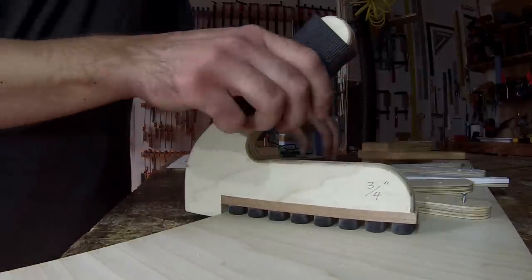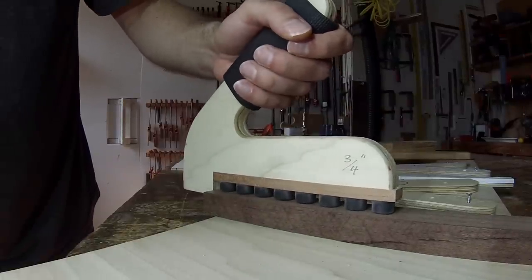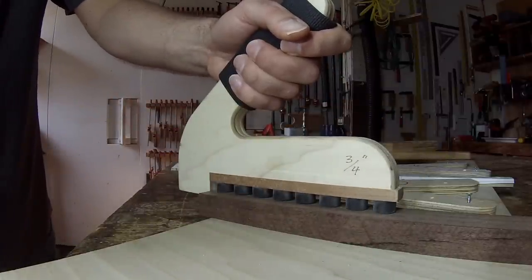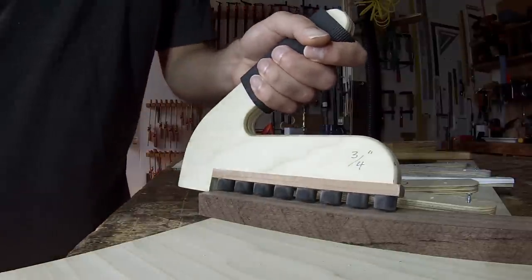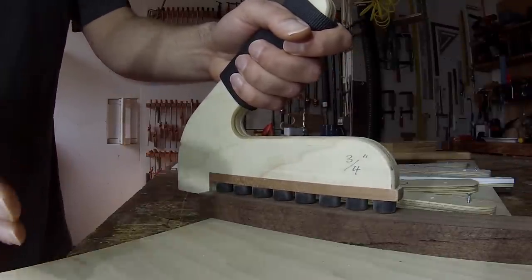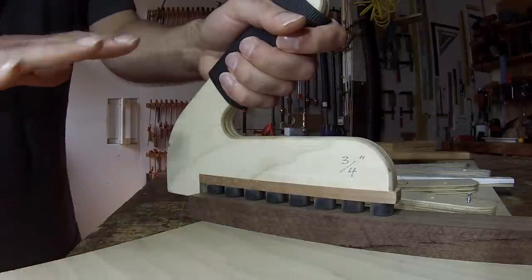Okay, because you don't want your workpiece to be vibrating, because sometimes you get vibration when you're feeding it through the saw. Okay, so applying pressure here is going to eliminate that vibration, eliminate that possibility of that workpiece kicking around, and that's what could lead to kickback. Everybody's afraid of kickback, and people seem to have some misconceptions about what causes kickback or what leads to it. And in my opinion, it's not keeping ample pressure down when things start shifting around.